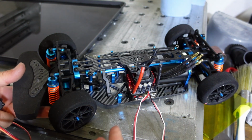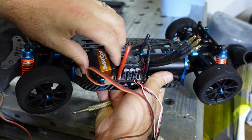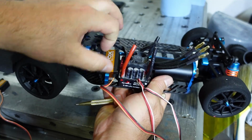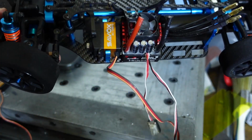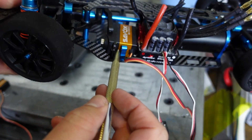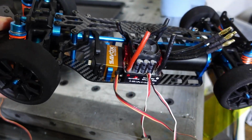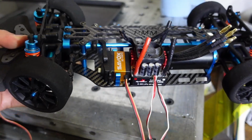If you see what we do with them, you'll understand. Okay, so this servo will go in there. It will bolt up to that standard servo bolt pattern mounting bracket that it has over there. But here's the problem. I need to now go at least 7-8 more millimeters to close that gap, but my servo is already up against the speed controller. There is no way I can fit this standard size 8th scale servo to this car anymore.